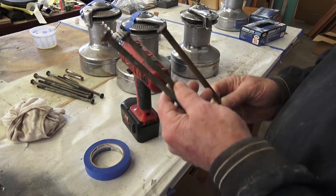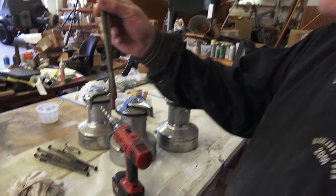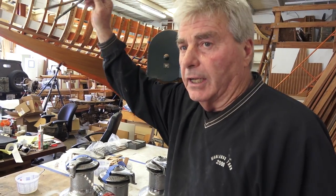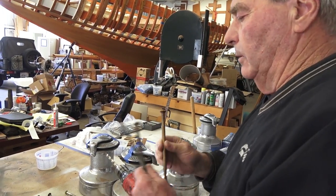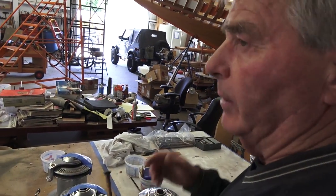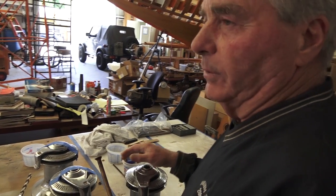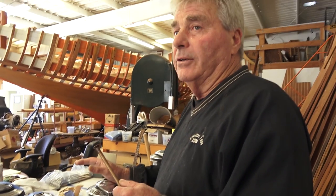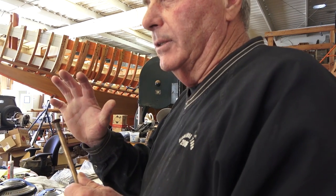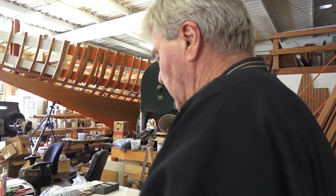So there's 6 holes. So we went from 5/16 to 3/8. And you see we had to get a longer bolt because we've added that blocking underneath the deck. Which is good. So bigger, longer, stronger. If you're going to overkill something, it should be right there. If you get a big head sail going, the winds in this channel come up like that, and you can load these winches up with literally hundreds of pounds in seconds. Some of these were slightly bent, like they'd been stressed a little. There's only 3 bolts per winch plus some screws, so we're going all bolts. All bolts, all set.